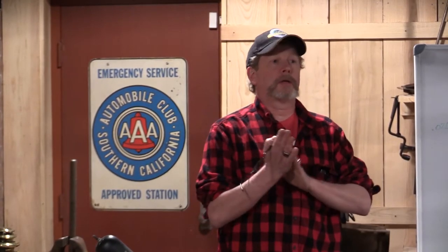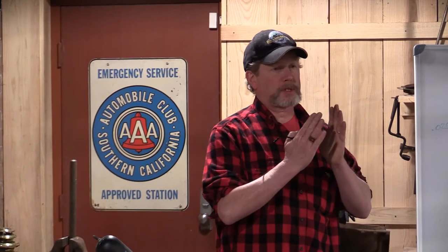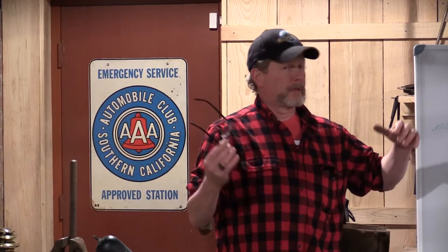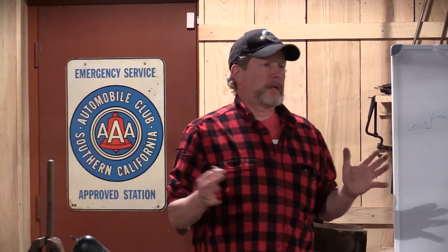And so you're hedging your bet a little bit by tinning the brass, and tinning is just making sure that before you put those pieces together, you've got an adhered layer of the solder on both parts. It's going to minimize the amount of solder that you have to plug into the seam to put it back together, and hopefully it's going to minimize the amount of mess. You've seen sloppy repairs before where the solder is just spilled out the sides and looking nasty. Tinning is a preventative to that, in my opinion. Tinning these parts is important; being able to border where the solder is is equally important.